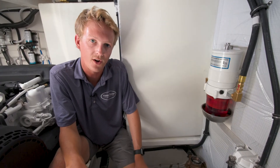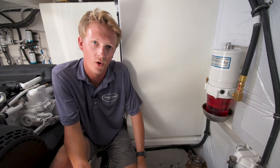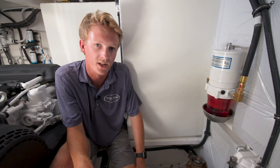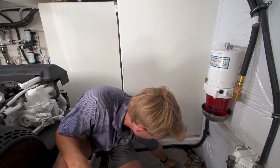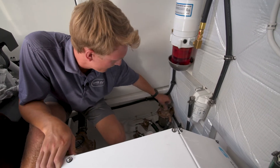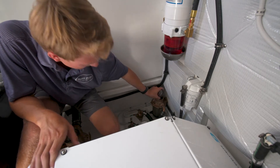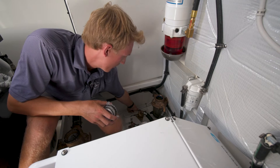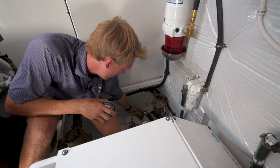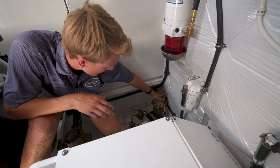After just cleaning your strainer, you might notice that your air conditioner is sending you an HPF — high pressure fault — or just shooting out warm air. The common cause for that is an air bubble in your cooling system. The remedy is to close the loop, open the strainer cap back up, and then using your through-hull valve, burp it — allowing water to completely fill the strainer. Once it's completely full, reinsert the basket all the way down to the bottom and screw your cap back on.